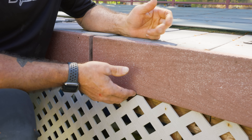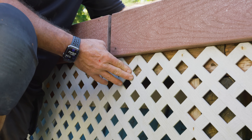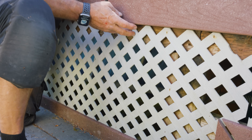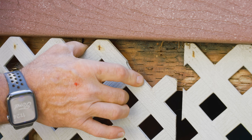You'll notice I used a deck board for my edging — a lot of people don't do that. This deck is 20 years old and I don't think it looks that bad. Now this next thing is totally my fault because I knew I shouldn't have done it: the skirting I used is vinyl, which really expands in the heat. I pinned the vinyl on both sides — top, bottom, and edges. You're not supposed to do that with vinyl skirting or vinyl lattice. You're supposed to pin one side tight and let the other side float so it has room to move. Because it was pinned, it bubbled and eventually broke right here because it didn't have enough room to move.